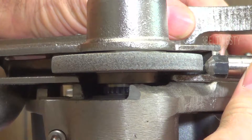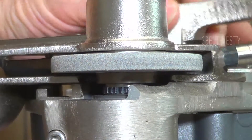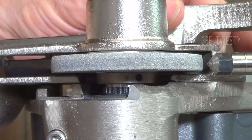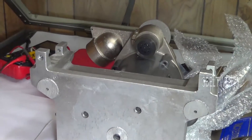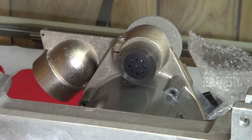If I have to adjust the bearing carriage I might do that, but it looks like this lines up just about where it should be. The diamond here goes back and forth to true-cut on the wheel — to dress it for the radius of hollow. And this is the bearing cartridge up here for the spindle, which is replaceable.